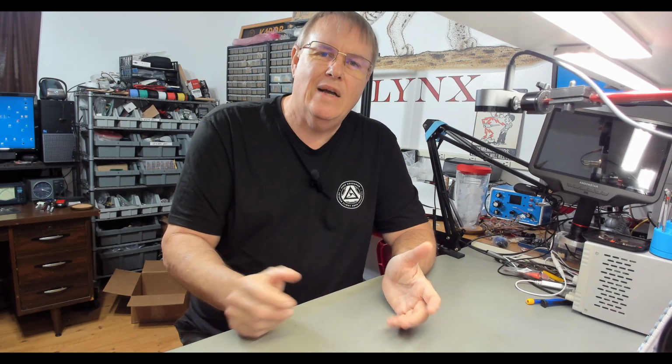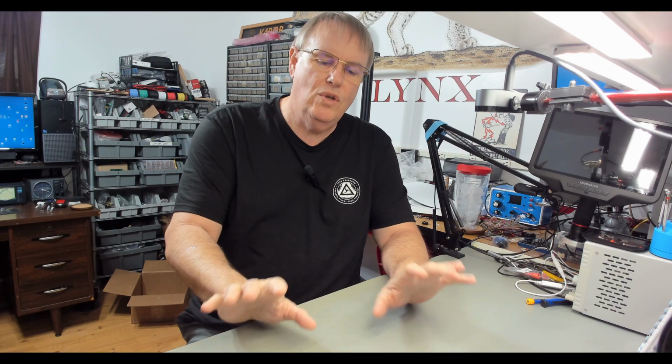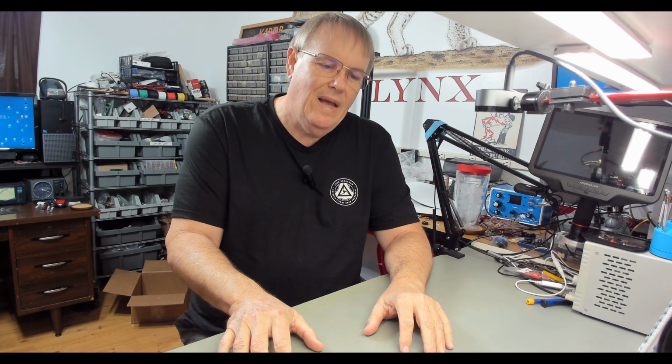What I'm going to do today is we're going to jump over onto the ham bench, and I'm going to do a little experiment which will demonstrate how they actually act and what they actually do. Now, I'm going to show you the SWR from the radio to the antenna tuner, and from the antenna tuner to the antenna. And what we're going to do is start out intentionally with a mismatched system where I tune my radio to a frequency my antenna is not resonant on. We're going to show you what's shown on both SWR meters. And then we're going to tune.